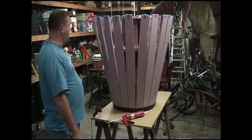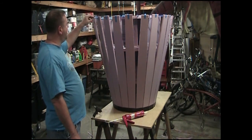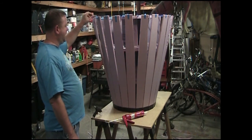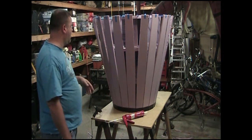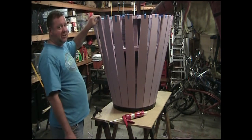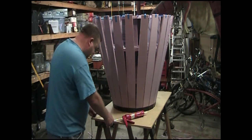So what we're going to do now is put the planks in place, and you want to start with the plank next to your baby plank. You want to do the custom-fit baby plank at the end, because if we have to adjust it more, we can. The other important thing here is don't just start ripping this tape off, because we're actually going to reuse it when we have to put it up against the end here. So we're going to be using both adhesives on this step.